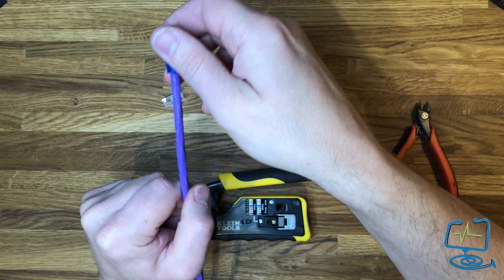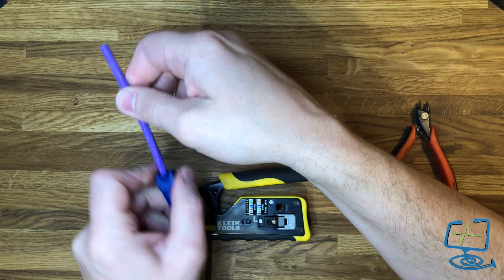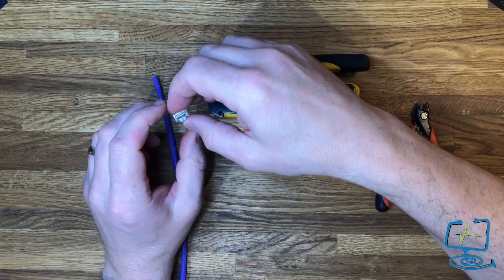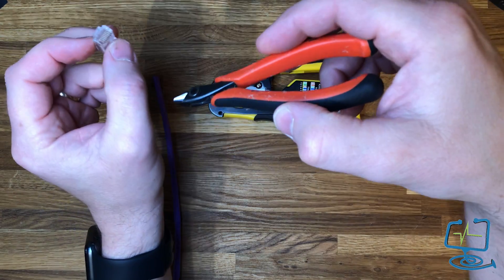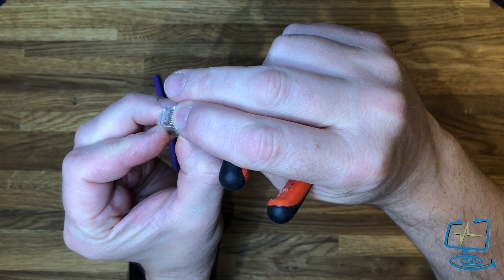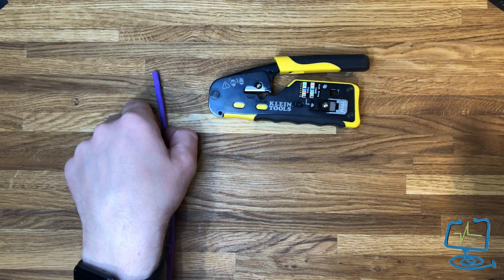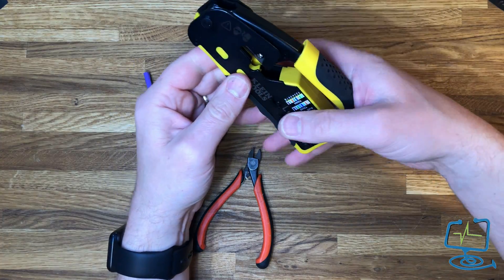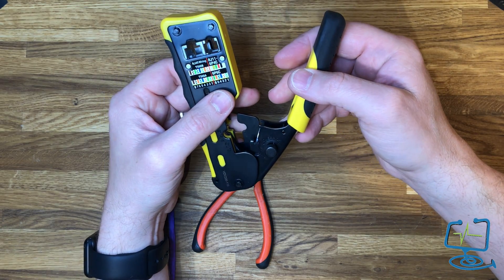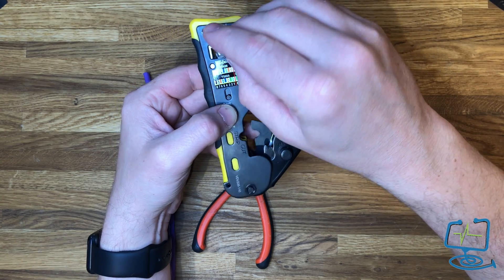Put your boots onto your cable — one facing each way — and push them out of the way while you carry on with your termination. The RJ45 pass-through connector, also called feed-through, has a little slot in the end where the cables pass through. This is really good because you can actually pull your cables through that slot, keeping everything nice and tight, stopping cross-interference and ensuring good connections.